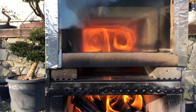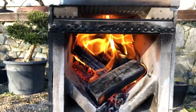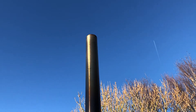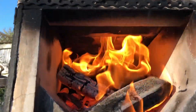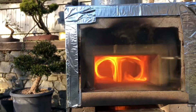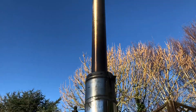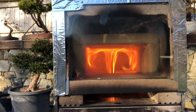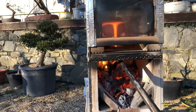The stove is in full flight at the moment, roaring away. I've added wood, I've poked it around, and there's no smoke coming out the chimney. We've achieved our goal — I've stopped it over-fueling by increasing and super-heating the secondary air. It seems to be running at around 400 degrees; the vermiculite around the vortex slot is at 400 degrees, which I think is about 650 Fahrenheit.